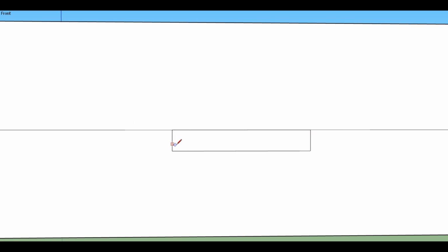If instead of straight, you had a slight angle like this on them, that would make it a lot easier. That's called draft. And this is kind of extreme. You don't need it that much. I think I've read like 5 degrees tends to be plenty if you're careful. But what you really don't want is something like this. This is called an undercut.